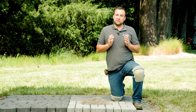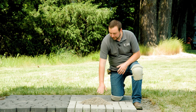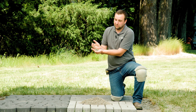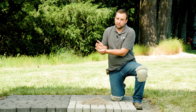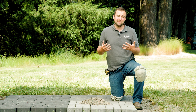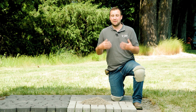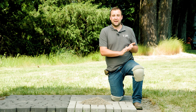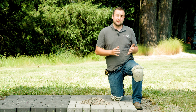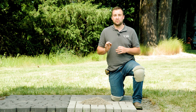One simple but effective joint material for a wide paver joint application is going to be crushed clean stone, specifically something three-eighths to a quarter of an inch. Here today we have our quarter clean stone that we use for bedding as well as the joint material for permeable paving stones. The nice thing about crushed clean stone is it's typically readily available, cost effective, and super easy to install — it sweeps into the joints very easily. All you have to do is compact those stones to help consolidate everything and maybe rinse off some dirt or dust. There is a little bit more maintenance involved, similar to bag dry sand, as you can accumulate a little bit of moss and weeds, but it still has great permeability and function if you need a good permeable system.